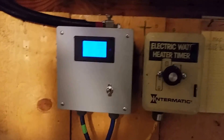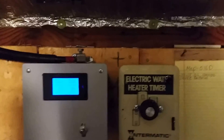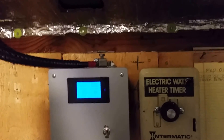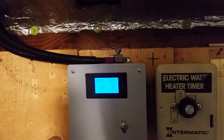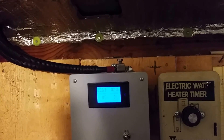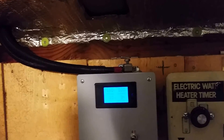My plan is to have it where I can run the voltage regulator that's in the alternator, and that'll get my batteries up to about 95% full pretty quick. But since that's a 27.3 volt voltage regulator and my system absorbs at 30 volts, I can come over here when I sense it's close to that, pull the switch out, and adjust this up where I'm seeing the voltage and current I want to run the absorb cycle on the batteries. When I'm absorbing, it starts to absorb, goes down to about 14 amps or so, and when it gets to 8 amps at 30 volts, the solar charge controllers kick it over to float.